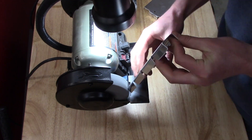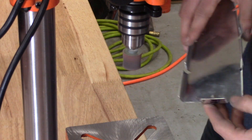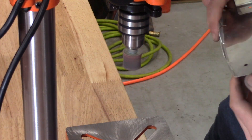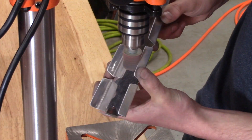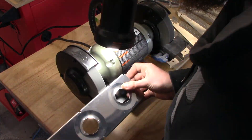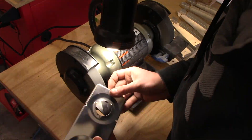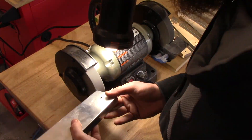As I said in a previous video, I did all of my deburring of those flanges — at least the very outside — before doing any seaming or fluting. It should hopefully save me a little bit of time later when I come back and do my final deburring and touch up all of the intricate details that I wasn't able to get with the bench grinder or the smaller Scotch-Brite wheel on the drill press. Here I'm cruising through all of the ribs for the entire horizontal stabilizer in preparation for the fluting and seaming operations.